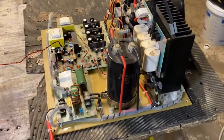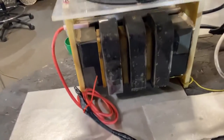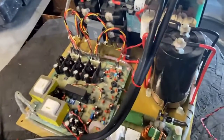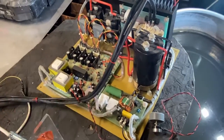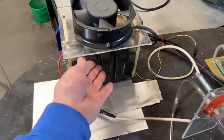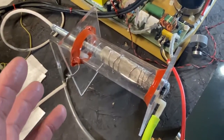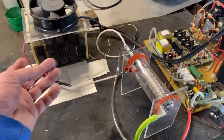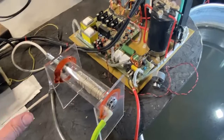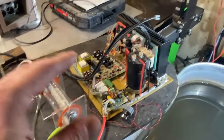This is the transformer driver — frequency plays a big role in ozone production. And this is the transformer. The reason why we have the driver is because it powers the high frequency that's needed to make a good ozone generator. It's not good to just hook this up to 230 volts and crank out a 60 Hz signal. In fact, it wouldn't even create the proper resonance needed to get a good glow. I have a neon sign transformer that puts out 50,000 volts and it's just terrible. There's something about the high frequency that is very good for ozone production — it's an absolute must.